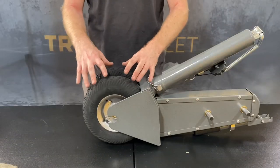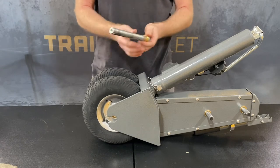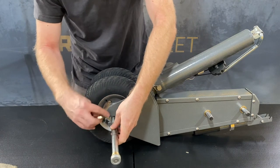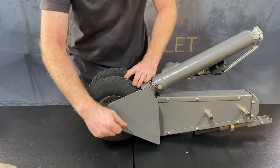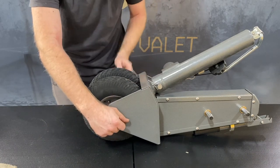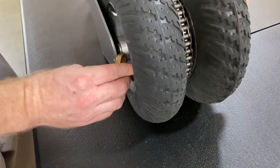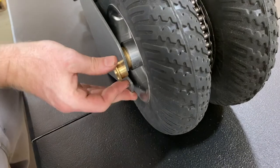Now that you've added the solid tires into the yoke housing, grab your axle with the brass bushing on. Make sure you grease it before sliding it into the housing. Once it's been greased, grab your bushing and the spacer and start to guide it into the housing. Once it's partially through, make sure you slot it through the brass spacer before you go through the drive wheel. Once halfway through with the axle and the spacer in, follow it through your follow wheel. Once you see the axle pop through on the follow wheel, don't go all the way through — grab your spacer and slot it in between the follow wheel and your housing. Push the axle through the bushing so it's held on.